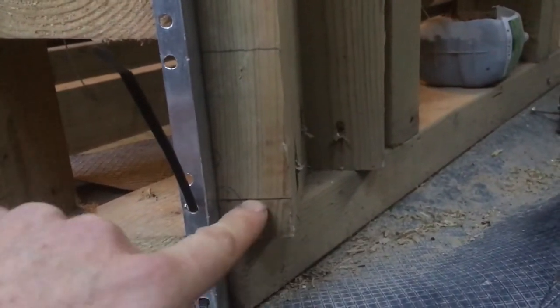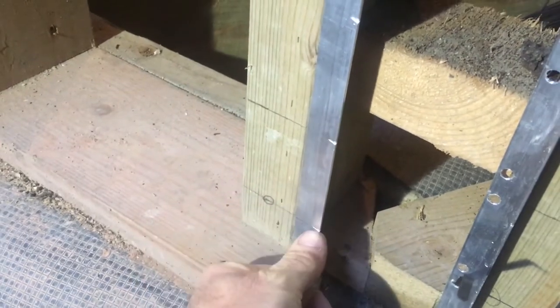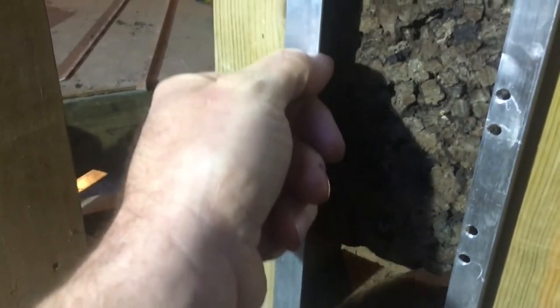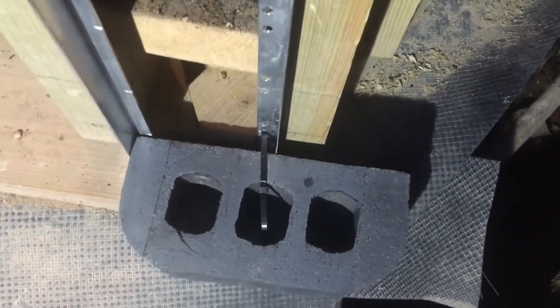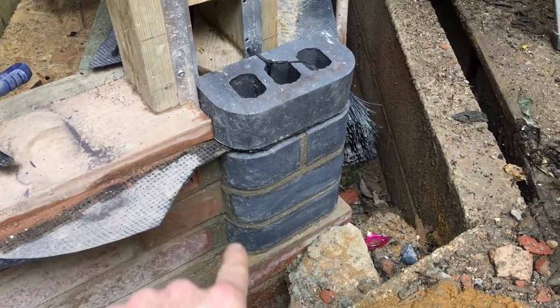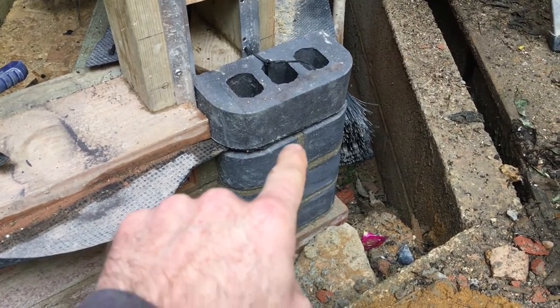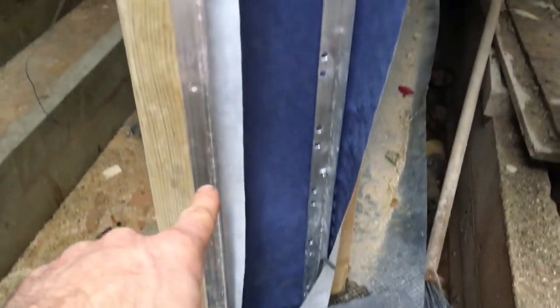This piece of angle is set up on that line and then each course of bricks is notched into the front of there at 75mm intervals. The tie for the brick goes in like that. This second piece of angle goes in like that, also set up on that line and notched at every course of bricks. And that defines this face here. Then I check the vertical with the laser level. And then put on the third piece of angle which defines the side of the brick column, and the brick ties in like this. Now I've projected downwards from this brick here to where I left off on the foundation and set up these first three bricks. And this is the first false bond. I've got the membrane in place now, so that completes the airtight envelope around the outside of the building in case there's any gaps at the edge of this brick column.